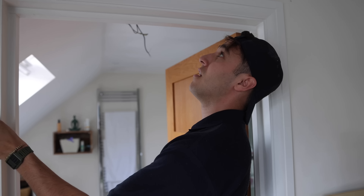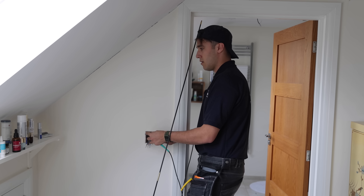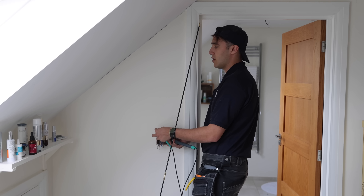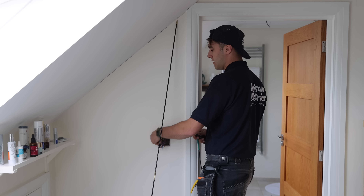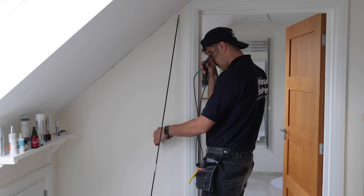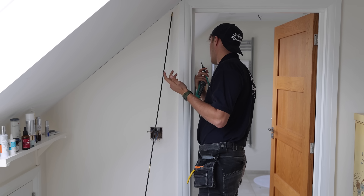So this cable here — don't cut off the ends yet. Let me just get my touch tester. Live and earth. Are they together? I'm just stripping it back — separate it. That's that. So if you want to just cut off the end of that and coil it up, we'll just label that spare and then that could just stay there. In actual fact, if they ever want to change anything, it's probably better not to cut it out — it's useful if it's a difficult route. The other ones I'm not too worried about because we can just rod a new cable up the wall, whereas this is obviously a difficult route if it's not pulling through. So we'll leave that in as a spare.